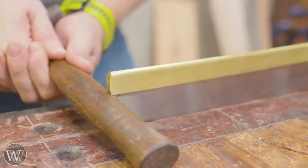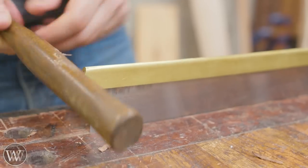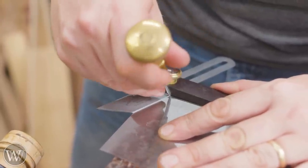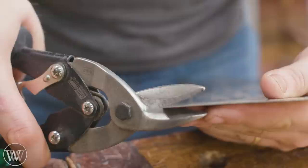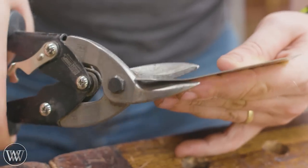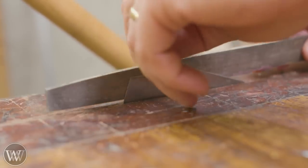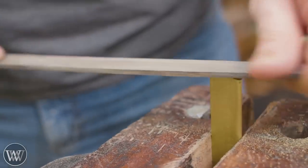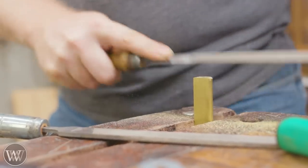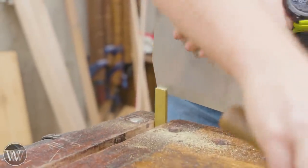This one has a rounded back so I want it to sit down a little bit more. At this point we need to take the back off, which can be a bit tricky especially if you have a really good folded back like these ones - the backs came from Florup Tools and he did an amazing job on them. To fit the plate into the handle we need to cut a bit of an angle on it. The nice thing with spring steel is you can work it pretty well - I'm going to come in with some tin snips, which will leave a little rough edge, but that's easily fixed with a file. We'll take the burrs off and make sure we get a good clean fit, and this will all slide inside the handle because we don't want it poking out into the middle.